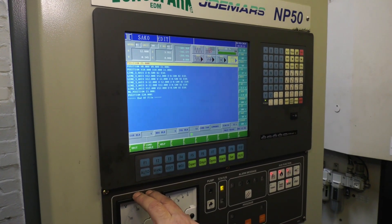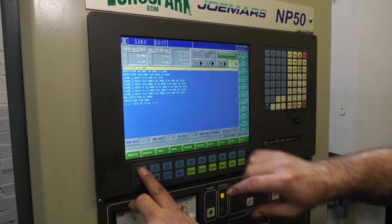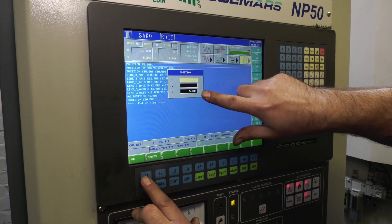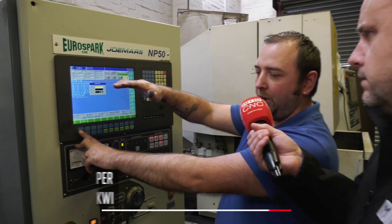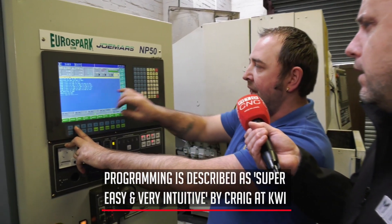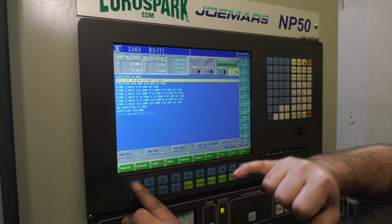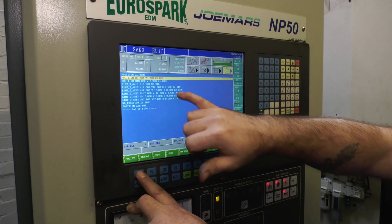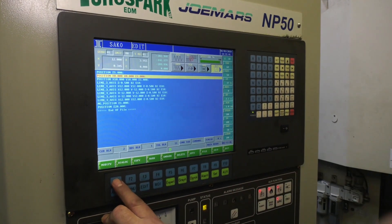So if you were doing it from the start, what would you do? Basically you'd write the program, so you'd go into your edit lines, go into edit your file, modify, and then you'd be able to change your actual positions in your X, Y and Z. Is that your starting position? Yeah, that would be your starting position. So you'd always come up with Z plus above the job so you don't crash into it. Your next line down then would be where the centre of the job actually is, with your Z still plus so you're not crashing into it and damaging the electrode or the workpiece. Then you'd carry on with your incremental positions with your X and your Y — it's a profile around the unit you're putting into the job.